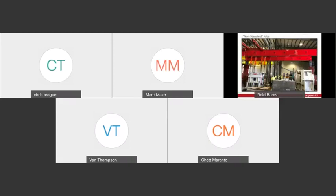So here's a picture of our box girders with the 450-ton J&Rs, and this picture is shown after they've been slid over there, lifted up, and then we used our gantry arrangement to set them. So lots of moving parts, but the things that I want to highlight are the high capacity and versatility of gantry systems, as well as the ability to carry the load beneath main structural members. So as you can see right here, you've got some main column beams that are making up the roof structure that we were able to get underneath. And again, same gantry legs, reconfigured in different arrangements on site, so you're reducing the amount of equipment that you've got to bring in for different scopes just because it's versatile and can be used in different type arrangements.